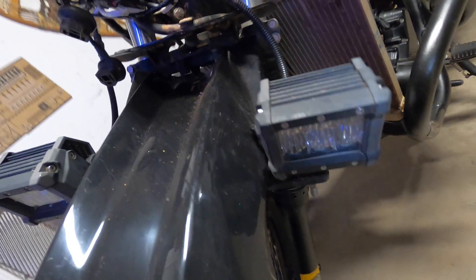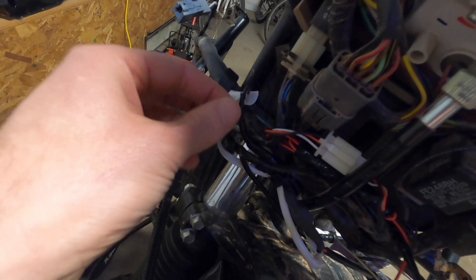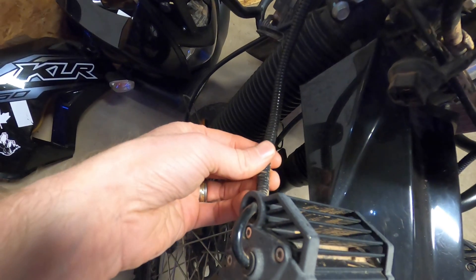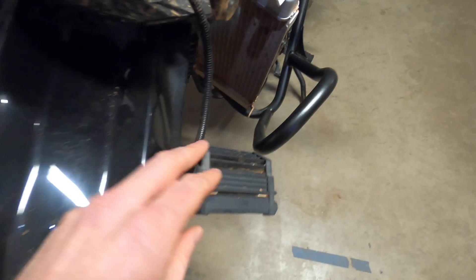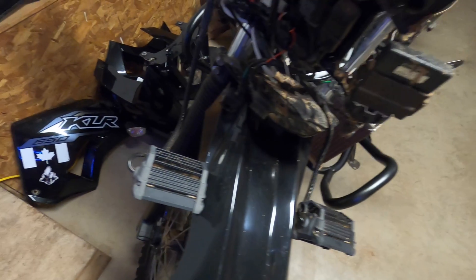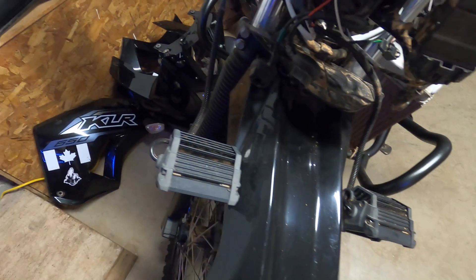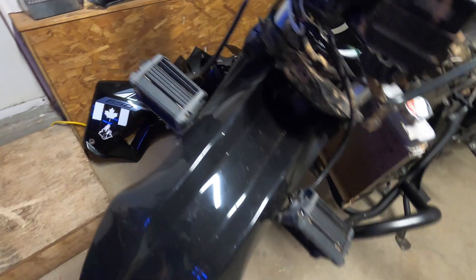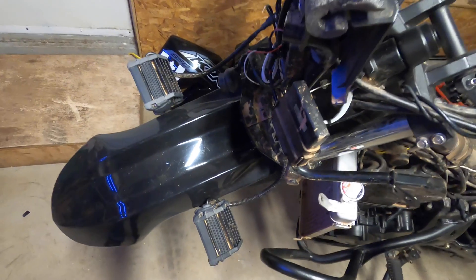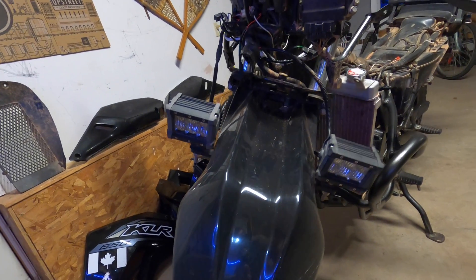You can use this parts list to get some inspiration, or just buy the whole thing as a kit and put it all together. There's a white wire and a black wire that connect to each LED, branched off so you get two lights in parallel — not in series. So they're going to take the same voltage across them, which is really good for LEDs because LEDs require a certain forward voltage to turn on. You get the max out of these when you're sitting at around 11.5 to 12.5 volts.